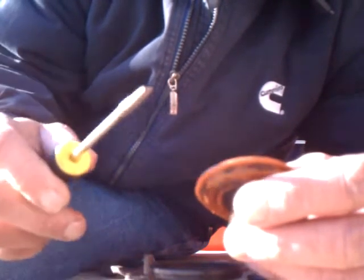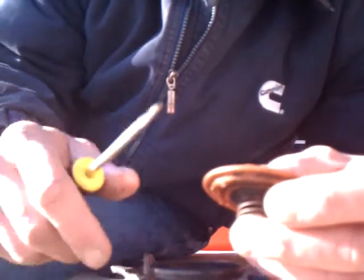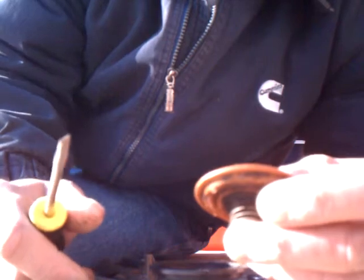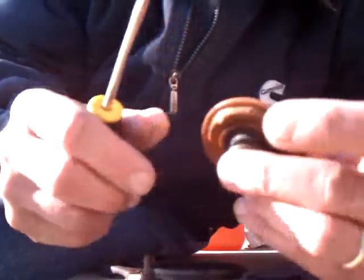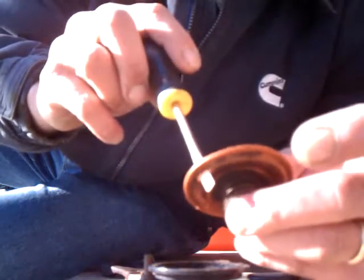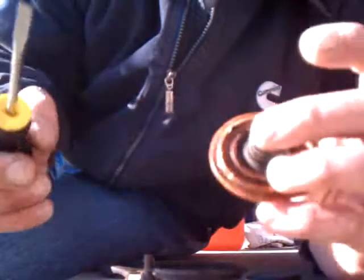The other test you do with the switching valve is hook up a 12-volt source to those two terminals — it should click and you should be able to shut off the air flow in that valve. You can also hook a vacuum up to that valve and see if it holds vacuum, though it's been said that if it's got a small leak in the valve it will still do fine and won't throw that code. So if you're having trouble with a P0401 code on a Toyota, you might want to check out this valve. That's it, thank you.